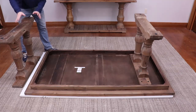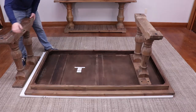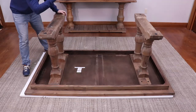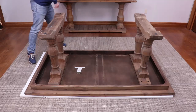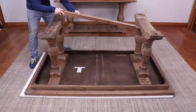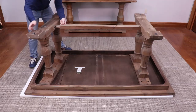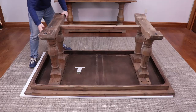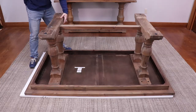Now that you've got your first leg installed, it's time to get ready for the second leg. Again, making sure the slot is inside, we want to line this leg up with the same types of slots that we used for the first leg. But here's the catch — we're not going to actually screw this in yet. We're going to take our stretcher, line it up with that notch that we wanted to make sure was inside, and put it in the far leg. Now you want to offset this close leg, get it in there, and make sure it's snug. Now it's time to use five more of the short bolts to connect this leg.